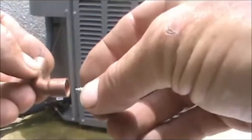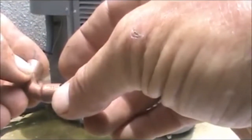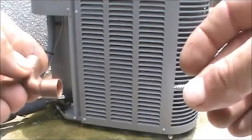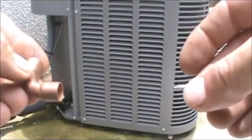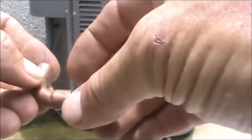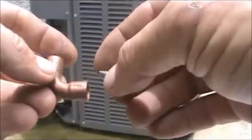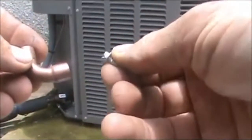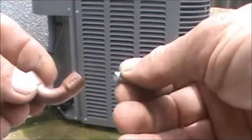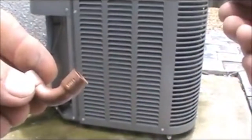What I found in my case was there were two 90s several feet apart, and this screw in cooling mode would slide down the 3/8-inch pipe to the first 90 — clunk — and restrict flow. In heating mode it would flow the other way until it hit the other 90 — clunk — and you could feel it and hear it. It was just a matter of finding where it was. Remember: do not keep your screws in the same drawer as your refrigeration fittings, because one day this will happen and it's going to be a bear to figure out.